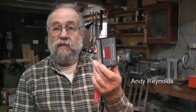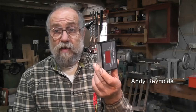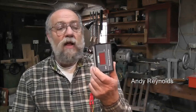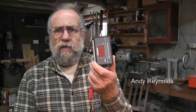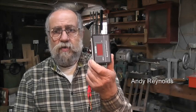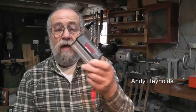That was a big fat no - it still didn't work. In fact it was worse because it didn't let any power through at all, whereas previously the motor was running flat out. Since then I've heard of another one doing exactly the same thing. These controllers are supposed to handle something like 5 to 60 volts for speed control, but I suspect they're only 12-volt units. Avoid them like the plague.